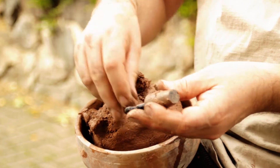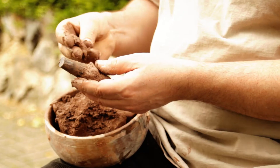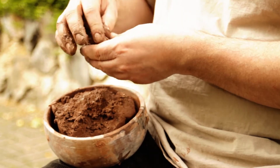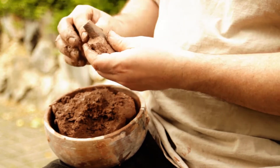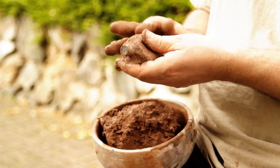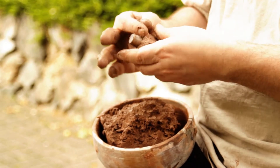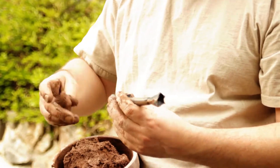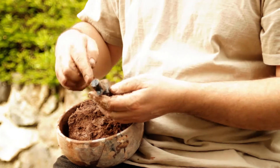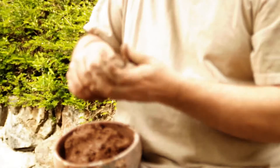The wax model is invested in molding clay. Molding clay actually has much more in common with loam than with clay, which is why it should be rather called molding loam. Clay is too fat and would, due to its shrinkage, result in a cracked mold. Molding material is thus made leaner by adding grog or temper.